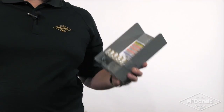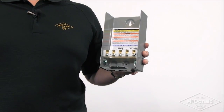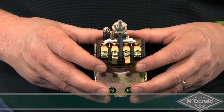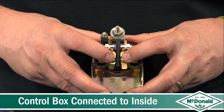In the three-wire system, your voltage is always checked in your control box on line one and line two. If you have proper voltage there, continue troubleshooting your pump. If not, go back to your pressure switch, where the power from your disconnect box will always go on the outside, and the power to your control box will always go on the inside.